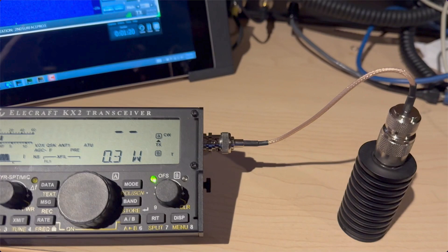I'm going to show you that and then talk about why it's significant. The way I'm doing this: I've got my KX2 and a dummy load connected to it. I've placed it near a radio — even though I'm transmitting into a dummy load, the radio nearby still picks up the signal. I've determined that setting the KX2 at 0.3 watts registers S7 on my Flex Radio.